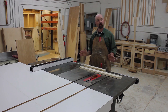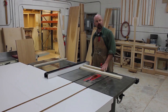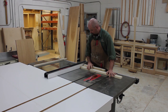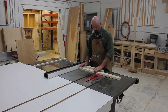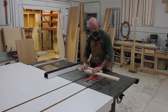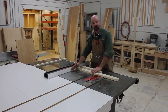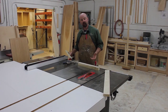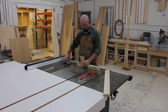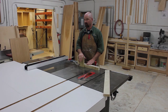One of the most important rules when you're crosscutting is you never want to use the miter gauge in conjunction with the fence. Here's why: if you do, you've got a point of contact and support here and a point of contact and support here, both operating in different directions. What could happen is the workpiece, once it's cut, could get trapped in between the spinning blade and the fence, creating a dangerous kickback situation. So we never want to use the fence in conjunction with the miter gauge. If you need consistent length cuts, you don't use the fence — use a stop block. This one may look archaic, but it's very safe and very consistent.